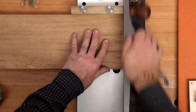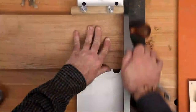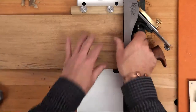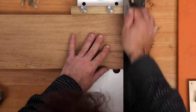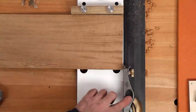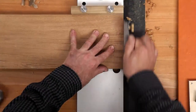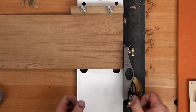Shoot the end of that panel, so I'm going to fit it in. Beautiful today. So I'm holding the top, finger and thumb. Okay, we did that one. A bit of block plane. Need a bit of cut. A little bit. So I need to just wind things up, finding where they are. Check I'm not clashing on the mouth for that. It's better. So we're taking a shaving cut on there. It doesn't have to be a big heavy plane on this. You could go with your block plane. That's nice, lower, a bit more compact.